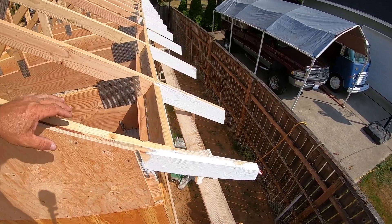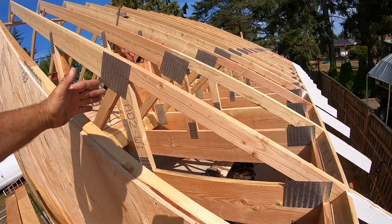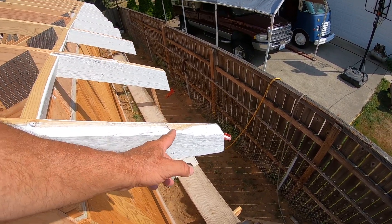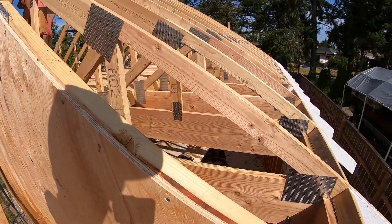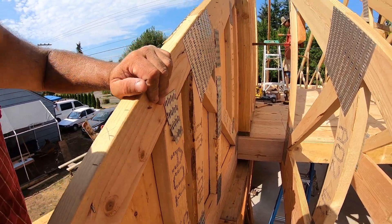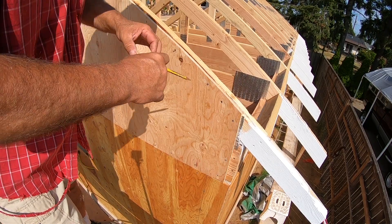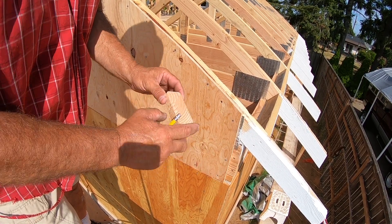I'm starting to cut these rafter tails or extensions or outriggers into this top truss as I go up. I'm going to let my plywood land at every two feet, four feet. I originally drew the plans for a one-foot extension on these tails — they gave me 18 inches, but I'm going to bring it back to one foot. My first outrigger is at two foot, my next one is at four foot. I laid these out making sure I'm going to miss all of my gang nails as I go up the truss — it's important not to cut into those gang nails for structural reasons, and because it's hard to cut. I'll use a chunk of the two by fours I'm going to use, since they vary a little bit, so I have one batch of all the same stuff.